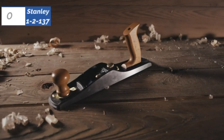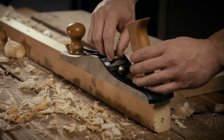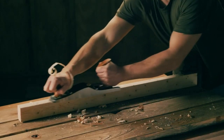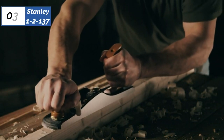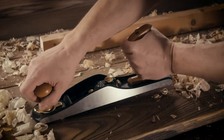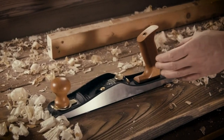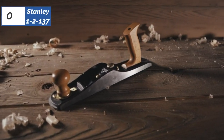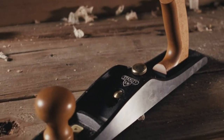The number 3 position is held by Stanley as the best rough lumber option available in the market. The Stanley Sweetheart Jack Plane is a large jack plane meant for smoothing rough sawn boards and timbers. It is made from iron castings, weighs over 6 pounds, and features two handles for controlled planing. Part of Stanley's Sweetheart Plane line, it has a one-piece shoe and frog unit, a thick steel blade, and a low-angle one-piece base for gliding over rough wood. It reduces chatter, and the 25-degree blade angle reduces tear-out when working with highly figured wood, despite encountering some handle issues during testing. This Stanley Sweetheart is a solid, high-quality tool that fits comfortably in the hand and has a beautiful finish, making it an ideal choice for wood craftsmen who work with raw lumber.